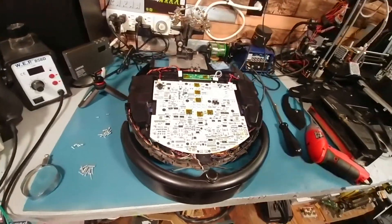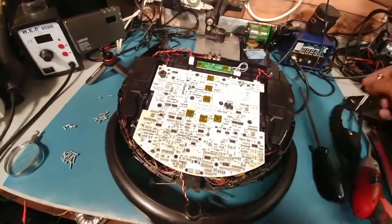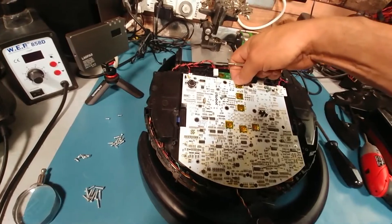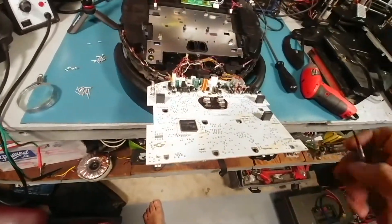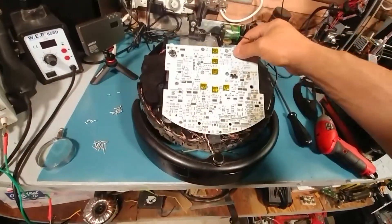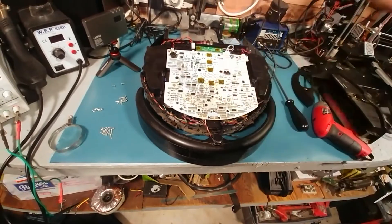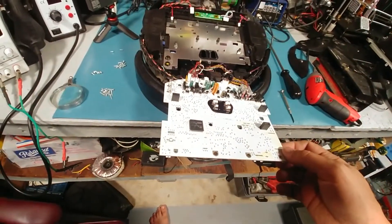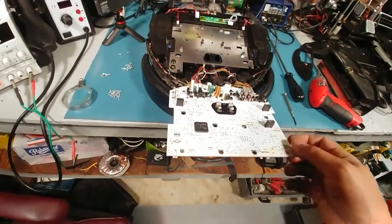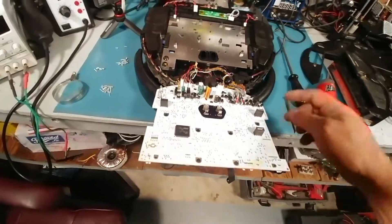So this is as far as we got — I had to take all that off. After all this, I found out all I have to do is use this through-hole. Basically the battery tabs are right there on the board. So if you turn it over, I just have to mark the negative and positive and solder to the board, then bring the leads up. So I still would have had to take it apart just to find that. This way I can see what the maximum voltage is on the capacitors so I don't have one pop, because I'm running 20 volts into it. I want to make sure these caps can handle it.